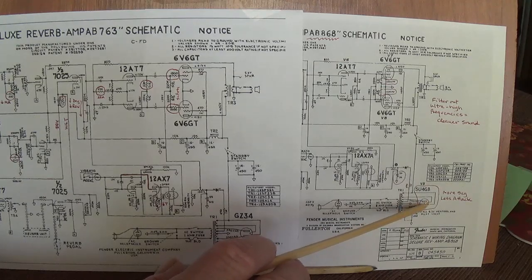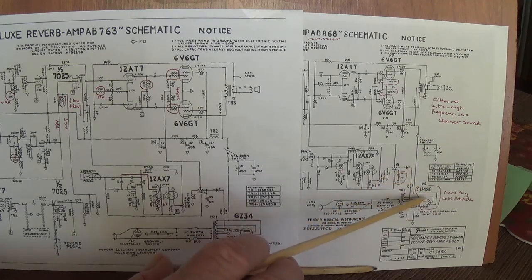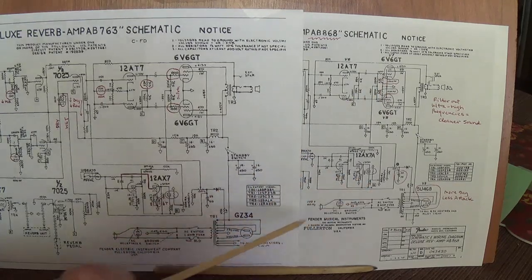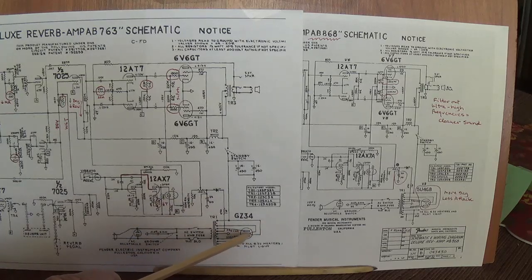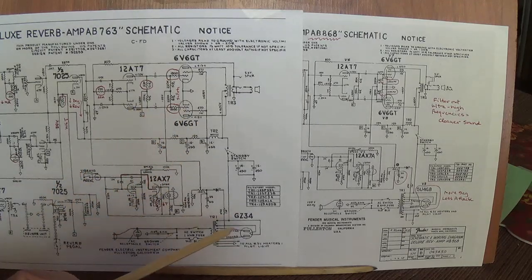Number one, it has a directly heated cathode, which means that the minute you flip the on-off switch, high voltage will start banging into all your tubes, whereas the GZ34 has an indirectly heated cathode, which means that after you turn on the power, you'll get a very gradual ramping up of current being output from the rectifier, which will gently power your tubes. So we have the slow startup here, which is very desirable.